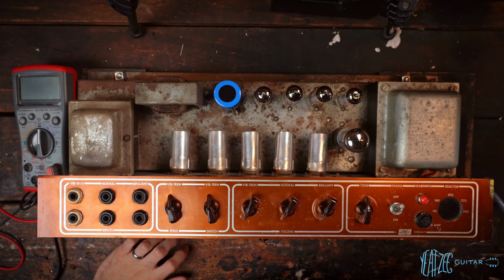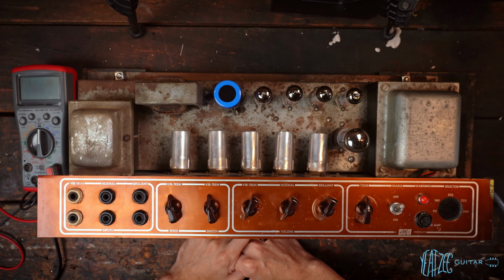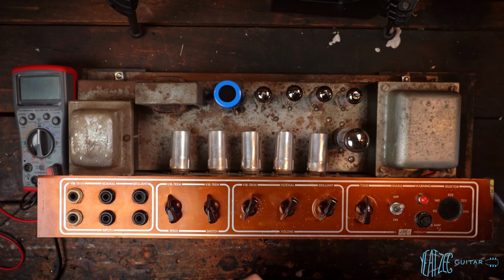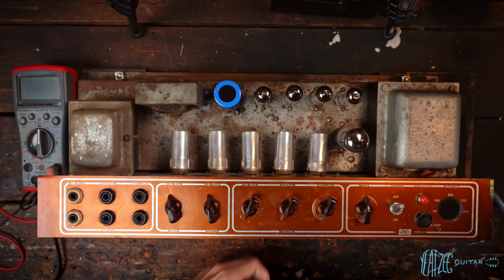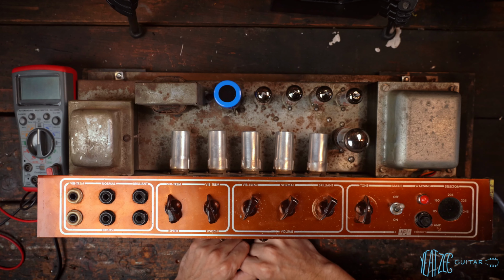To me, it sounded like it was a vibration thing. With the closed back cab that this amplifier has, it puts out so much low end that the head on top of the cab is definitely getting a lot of vibration. So it felt to me like when I was doing those slide ups on the Les Paul, it was hitting a note that was making it vibrate a certain way that was inducing that.